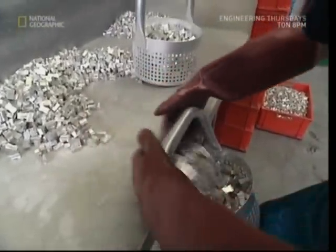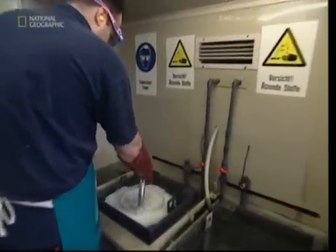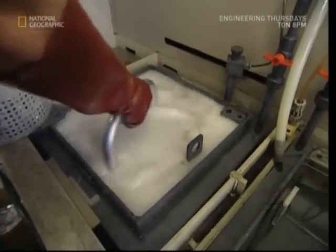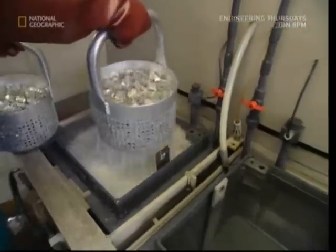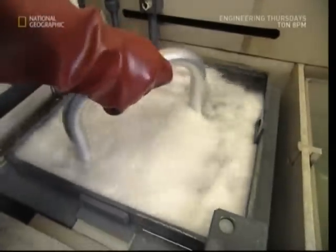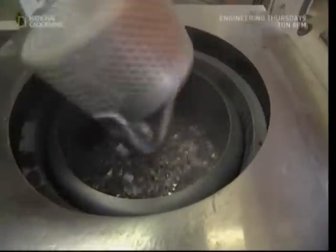The blocks look like sharpeners but all the work has made them rather dirty, and they wouldn't go well with a shiny new pencil case. They're loaded into special baskets which will help them survive the next stage of the process: a highly corrosive bath in nitric acid. Too long and the sharpeners will dissolve, but a short bath will shine them up nicely. The blanks are then rinsed and spun to dry them.